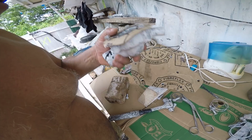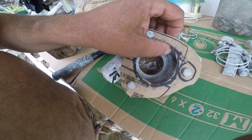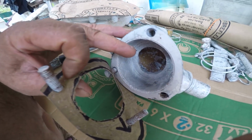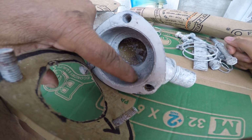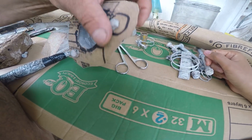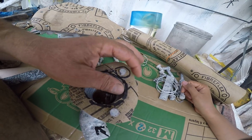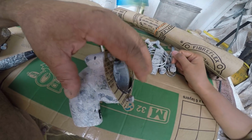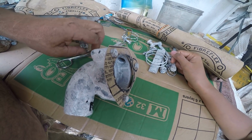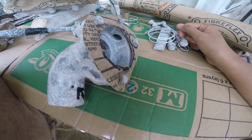Like I have another gasket I just made. I cut this one with a scissor. The reason I cut this one with a scissor from the inside is because this is all open over here. And that's just two ways of doing it. It was a different video to show you a different method. I just did that light tapping with the hammer, very light, made a mark on the inside, and then punched a hole in the center of this gasket material and then scissored around.